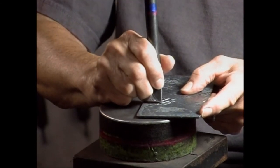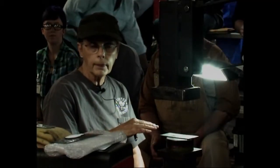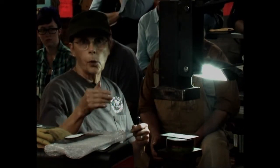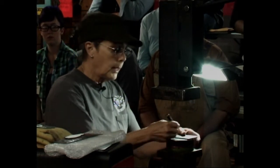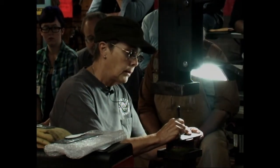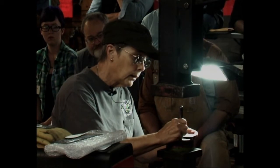Mindy, do you usually work with paper over your steel? For just doing the chisel lines to outline my drawings, I'll leave the paper on. When I'm done with that, most of the time I'll pull the paper off. Unless it's a really complex design, I'll leave the paper on and pull it off as I'm going, so I can remember which way my butcher is supposed to face. And I did bring a handout. It's on a CD, and it explains doing all that.